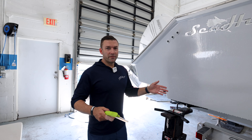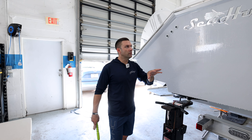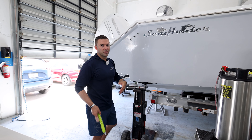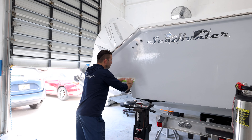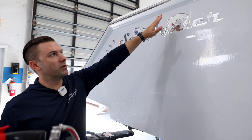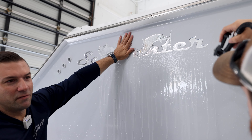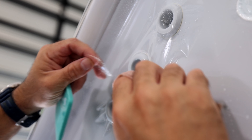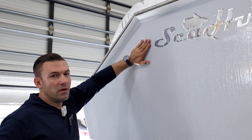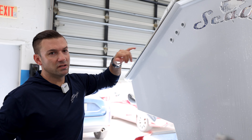Once we've completed a full cleaning of the hull side, we're going to clean it again just to make sure nothing settled on it from air blowing around. Use a regular squeegee and always spray and pull from the top down. Pay close attention to through-holes — when you're spraying, water drains back out, and if you put the film up with anything deep in those holes, it'll roll back out into the film.